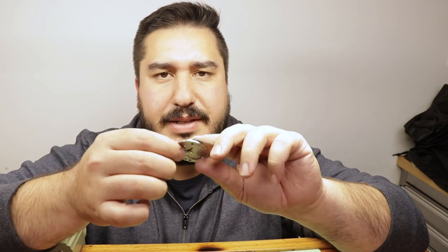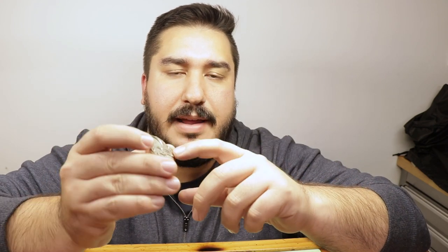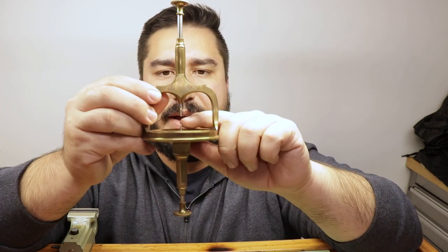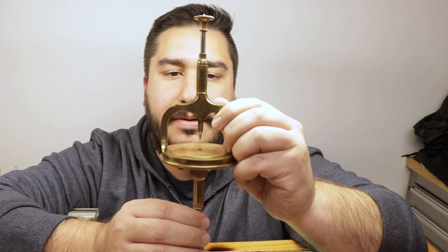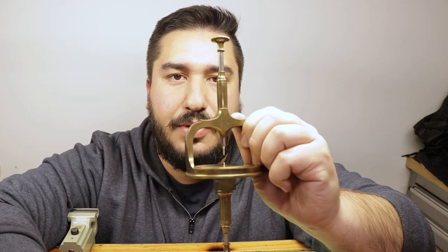Now that I've super glued the main plate to this brass piece, I need to transfer the holes for the alignment pins, the screw, and the jewel hole. I'm going to do that with a very special antique tool known as the uprighting tool. The bottom section has a squared-off section which sits in the vise. There are two adjustable spindles with sharp points on both ends. The top piece is used to align the original hole location, then you use the bottom to mark the location of the hole on the brass piece.